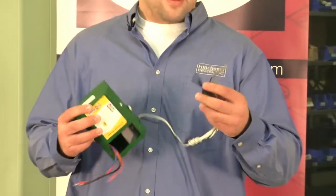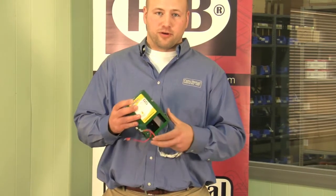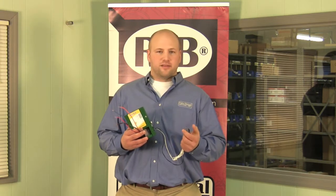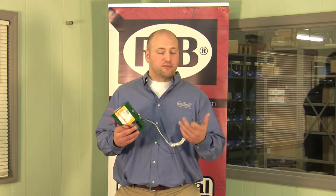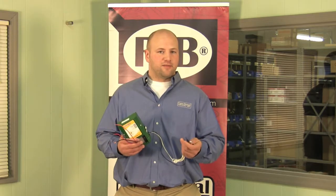The thermistors: black is for your exhaust on your fan and the white is for your intake, and they detect the difference in temperature to know whether your compressor is running or not. The concept is really easy — using these thermistors, it tells the differential in temperature. If it's greater than three degrees, the compressor is obviously on. You need it to be running, your fans will be running at full speed. If it's not, it runs at low speed and you get some energy savings there.